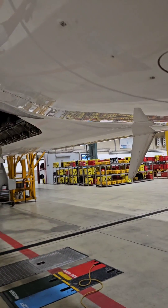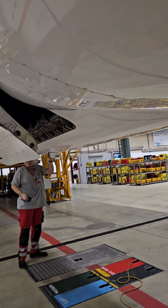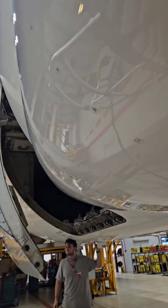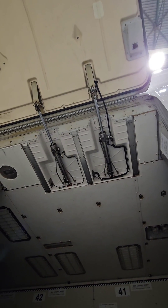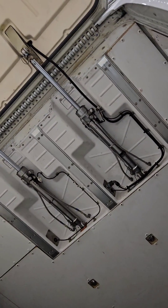I'm ready — meanwhile my colleague unlocked the cargo doors and he is ready to operate the selector valve. Now we follow the same procedure as we use with the yellow hydraulic pump, except at the moment I am the power source so it is much slower. After endless pumping the door is finally open and the actuators are locked.